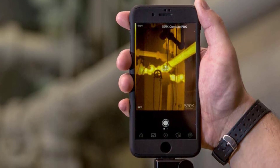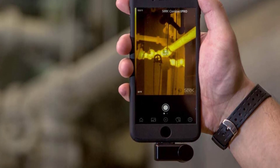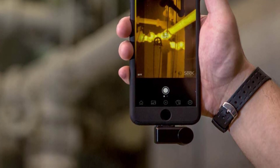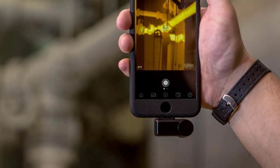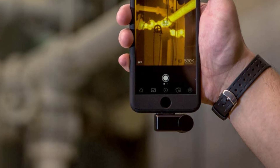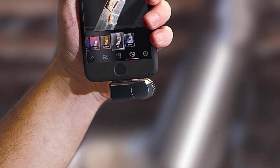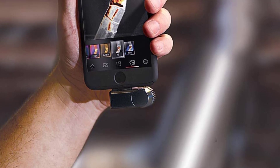It is simple to use — you don't need a user manual to start capturing images. It works differently because it only has an infrared sensor built in, with no battery or visual camera, as it uses the smartphone's own resources. This camera has two very strong points: first, its 320x240 thermal resolution providing 76,800 pixels, meaning you probably won't even need MSX. Second, it can detect warm and cold areas up to 1,800 feet away — something you won't usually find in an all-purpose IR camera. The FLIR doesn't even get close to 300 feet; that kind of detection distance is more typical of thermal scopes like the FLIR Scout TK or Leupold LTO Quest.